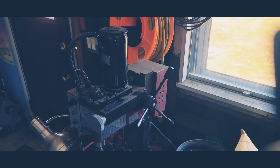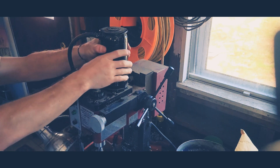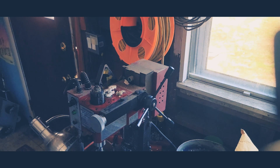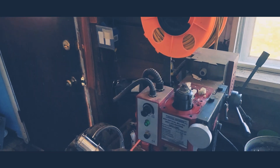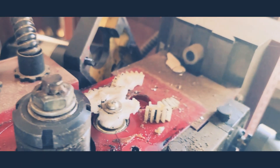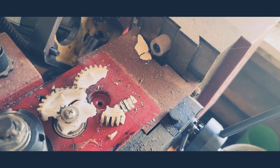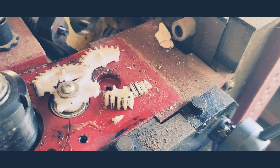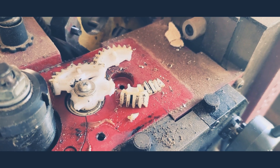Okay, let's crack this case open and see just what exactly broke inside. Well, as you can see, it appears to be the worst case scenario. I was hoping there would be something like a shear pin inside that could be easily replaced, but Harbor Freight being Harbor Freight, they used nylon gears and it looks like the nylon gears are the fail point here.